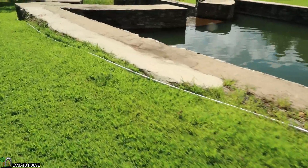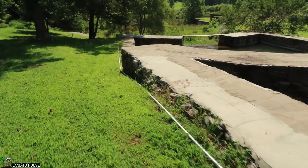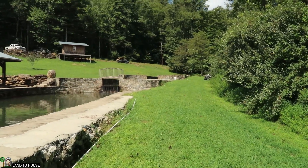The only other option would be to come down to about this next terrace and put in a stand pipe. And that would match the bucket source up there, but make the drive pipe a lot shorter. So we'll just see what we get here.